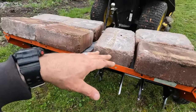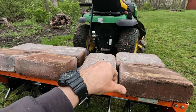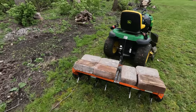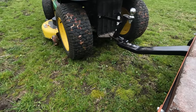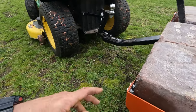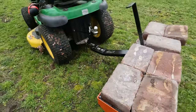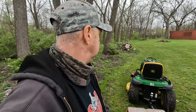That extra weight also means more work for your tractor. This is a John Deere L120 — it's no heavy-duty tractor, it's really just a fancy lawnmower. So you want to be careful not to overheat the transmission. You could cook the fluid in there if you pulled it around for a couple of hours with a lot of weight where it's digging in really good. Maybe don't put quite as much weight if you've got more to do and the ground is wet. I don't have an exact number for how wet the soil is — you just have to figure that out. I noticed one day it seemed to be struggling a little, and I checked the transmission by hand and it was toasty. Something to watch for.